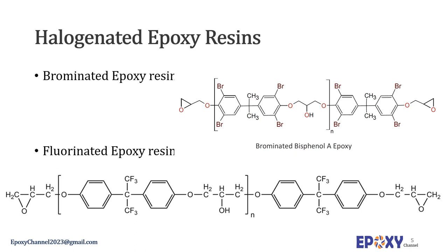Some non-crosslinking epoxy resins with very high molar masses are added to engineering thermoplastics to achieve flame retardant properties; they often have a high molecular weight. A wide variety of these resins are available for 150 to 180°C applications. Brominated epoxy resins may be cured using either dicyandiamide or novolac curing agents, both one-part and two-part systems are available. Generally these resins are used for printed circuit board processing.